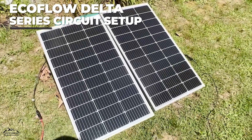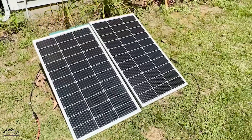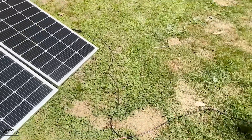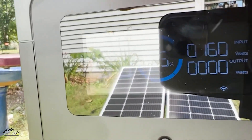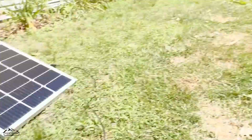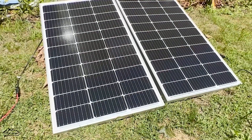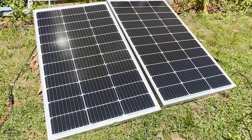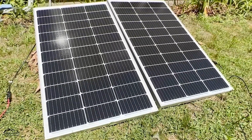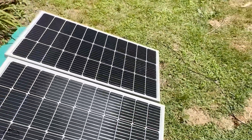Now you can see I have two 100 watt panels wired in series, and as long as I'm not over any of them — come over here and we'll check — you'll see it's at 160 watts. The single panel was at 82 watts; they're not at the best angle right now so that's why we're getting 160, basically 80 out of each. So now let's put a leaf or a handful of leaves on just one of them.